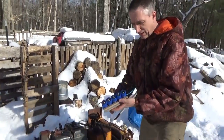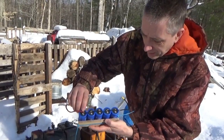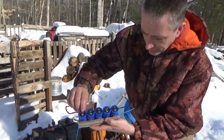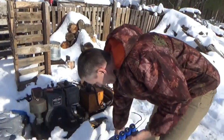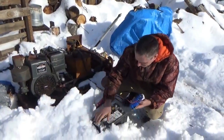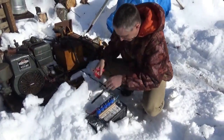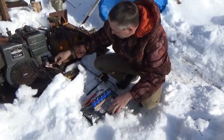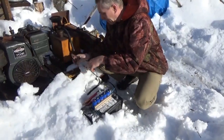Here's the issue I was worried about: these leads coming out of here are super tiny. I've soldered on 12-gauge wire but the lead is equivalent to maybe 16-gauge, and that can't carry the current of a starter wire like this. We're going to find out if this will work. I'm going to hook this up to the capacitors instead of the starter battery. Chris, everything else is good? Yep.